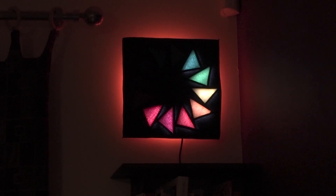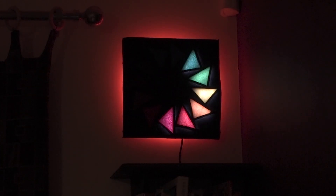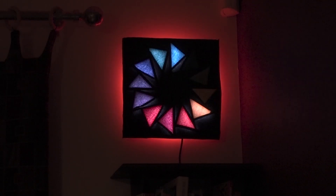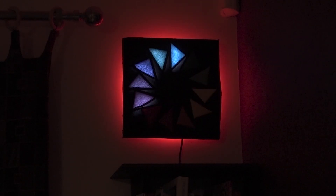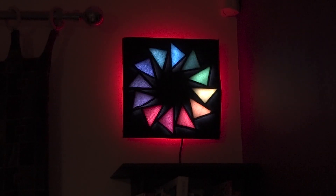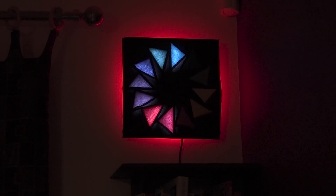This also doubles up for when I trail off mid-sentence. There is a timer for soft-boiled eggs, which runs for four minutes, and one for hard-boiled eggs, which runs for ten. While the timer is running, the green value descends from 255 to zero and the red value does the reverse. A quick glance at the wall tells you roughly how far through cooking the eggs are. At halfway, the light is equal parts red and green — otherwise known as orange — and once complete, the wall glows red before the lights blink off.